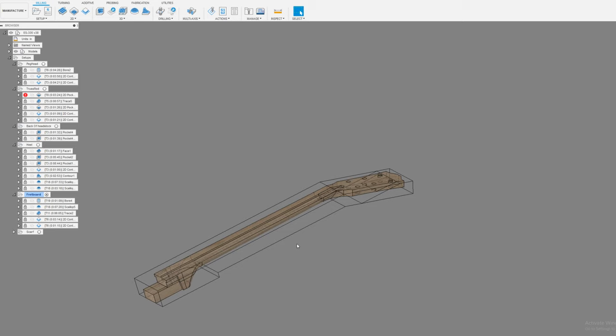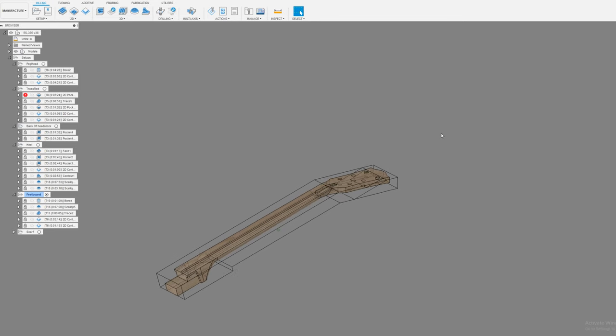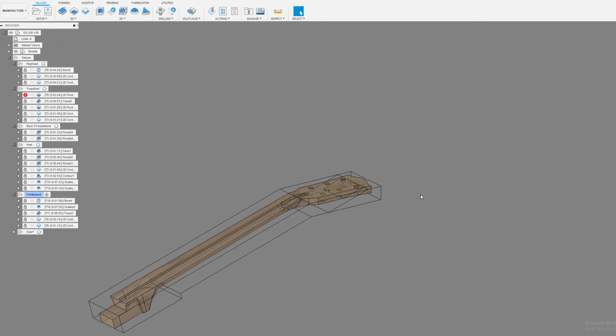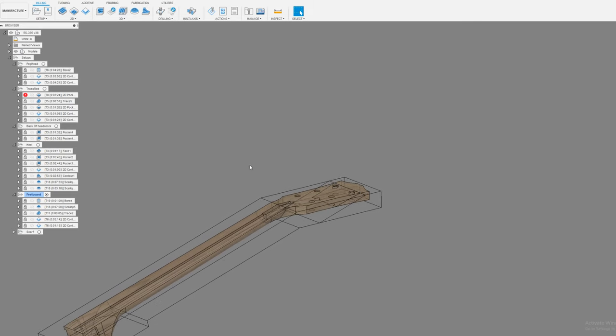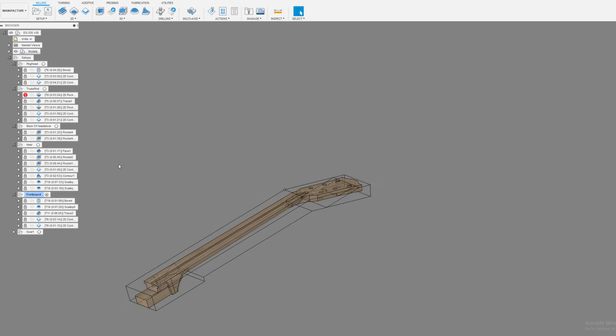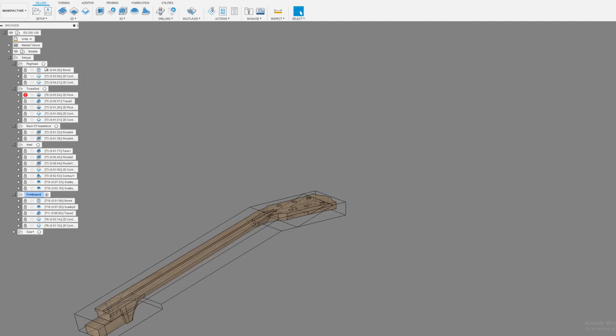So the first thing is to get that stock dead on, so you have a really nice, accurate piece of stock to start with. And then all of my measurements and all the ways I indicate on the CNC bed are going to be from this one edge, whether it's this side or this side, and essentially from this point or this point. During the flip, I will indicate from this point here, but it has been defined in the previous operation. So let's just walk through them and I'll show you what's going on.